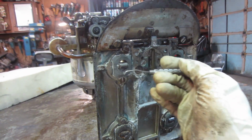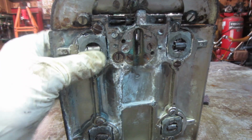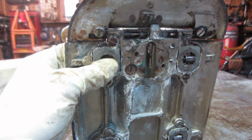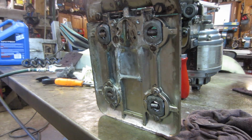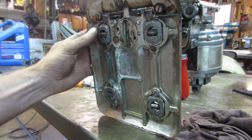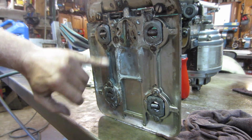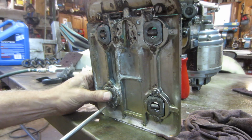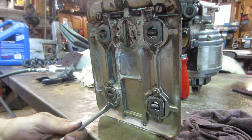It's already getting better. I wonder if that pad is supposed to be kind of spring-loaded too. So I took this one apart and cleaned it, and it's got little rubber feet underneath it. You can see how the whole body's going. And that's actually a roller bearing in the center of it. Let's go, that one's locked right up. It floats, but it locks right up. The bearing is locked up.